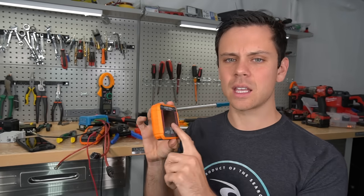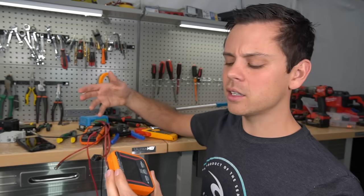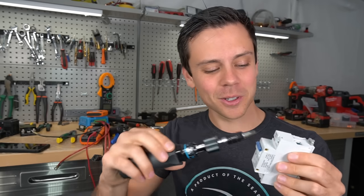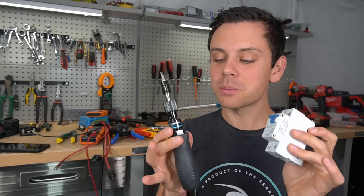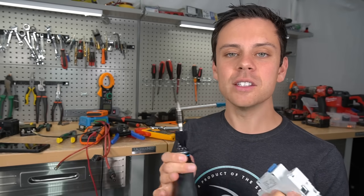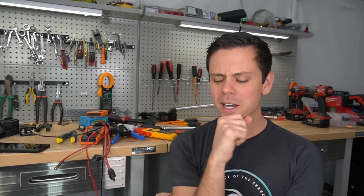With any system, a heat camera is fantastic for seeing if a device is failing, if terminals or conductors are failing, or if a circuit breaker is failing. Use a torque screwdriver, put it to the right torque spec on the label, and tighten it down until it clicks — that will avoid most problems. I've seen so many solar charge controllers with loose terminals; if you can pull a wire out with your hand, something is not tightened to the torque spec.